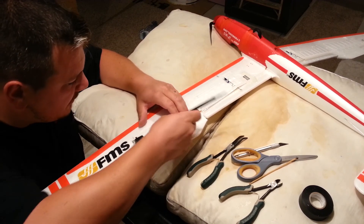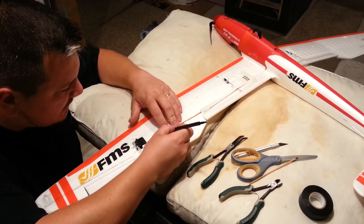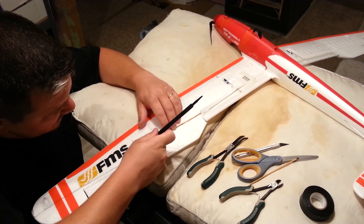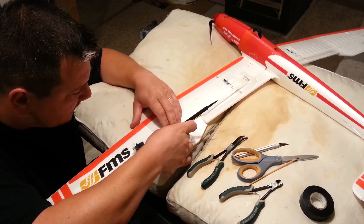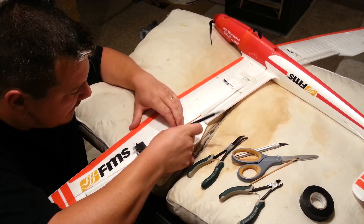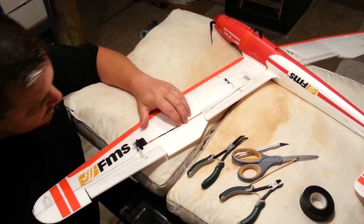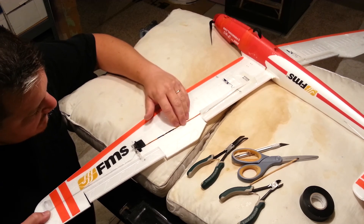It's weird too, this one has one less resistor. I did two resistors on the other side and just one on this side. The reason we do two resistors — on the red side — is that they handle the load of the red LEDs better in a pair. Otherwise I lose intensity and have to go with a higher resistor, which limits the current further to the actual LEDs and bears the load on the resistor itself.